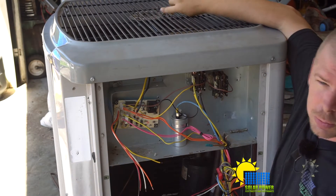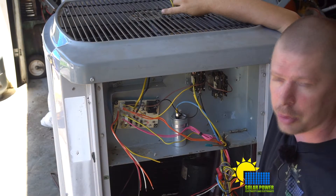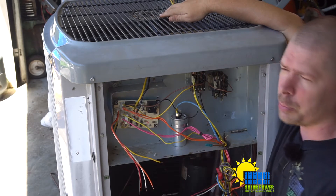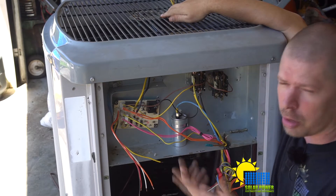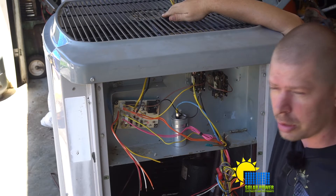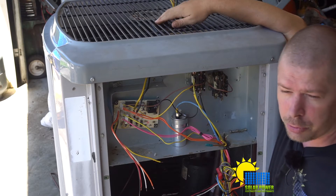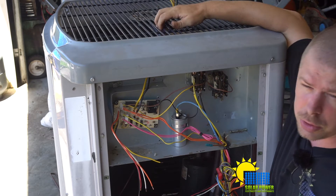I'm gonna trim these pieces of metal off so I don't stab the coil - I had to fix it, but it's one I can fix because it's copper. Holy crap, you'd think that engineers back in the day would have thought about it. Copper is a better heat conductor than aluminum. Copper is solderable on the job without expensive machinery like a TIG welder, because that aluminum rod sucks. If you're getting it for refrigeration, you're a fool - it might work for other applications, but it sure doesn't work for refrigeration.